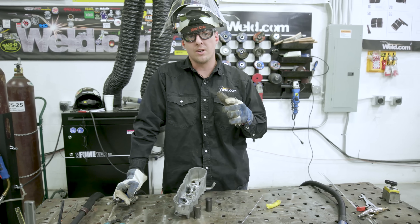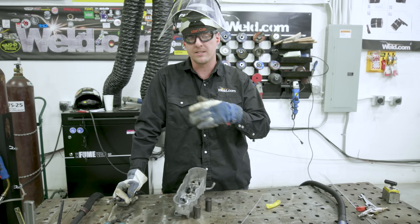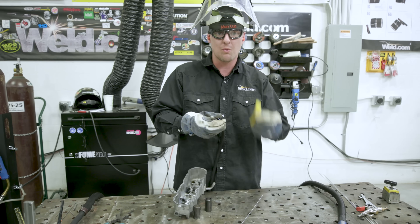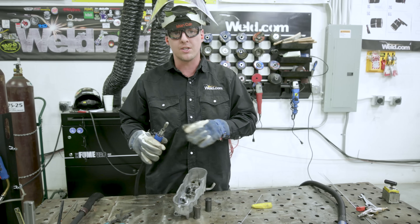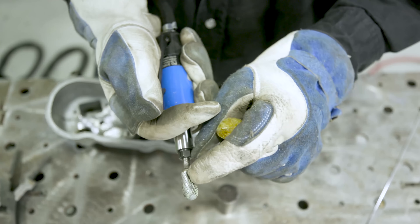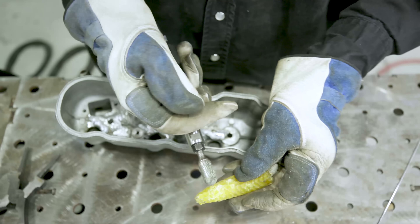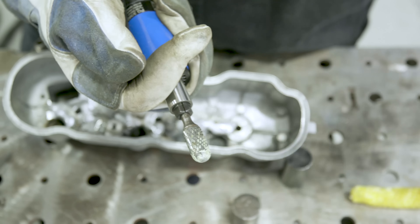All right, we got all the cracks covered up and basically all stopped. It's not pretty because of the oil. We're going to use the Ferg tool with a carbide bit — always use wax so it won't plug up — and smooth all the ugliness out. The reason for the wax is so the aluminum bits don't clog up the carbide when grinding. Just put your finger under there and run it on the bit a little.